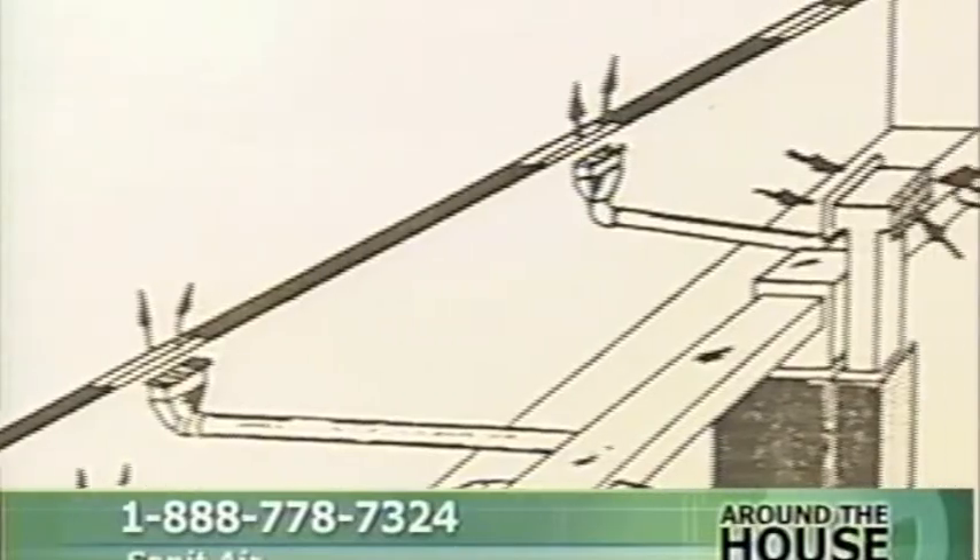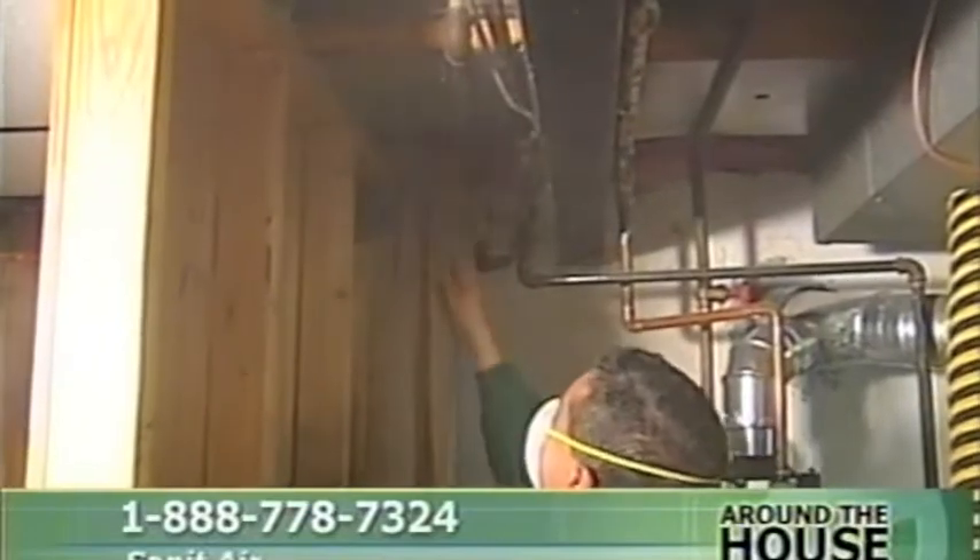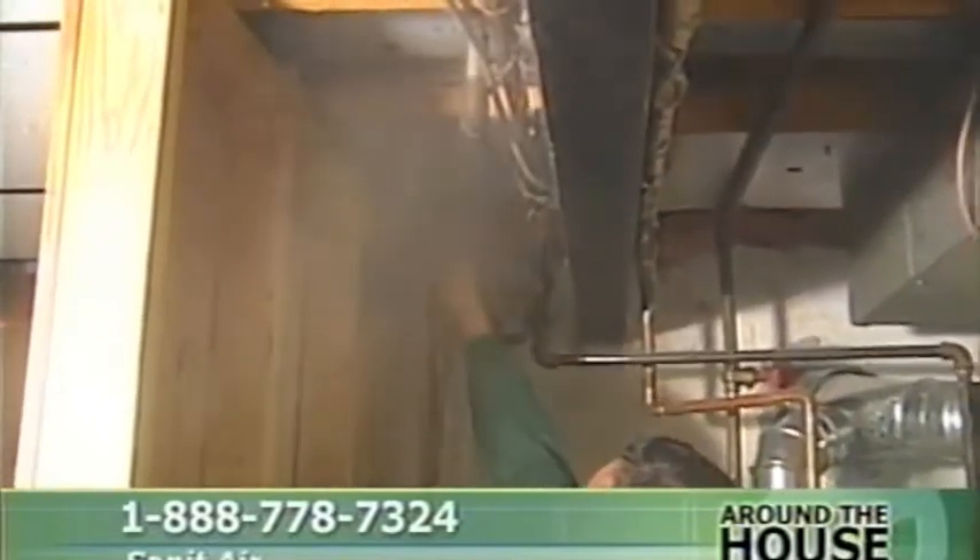So first, what we'll do in a home is tape the vents and registers. Next, we drill one-inch holes — this is what they're plugged with. Into these holes, we insert an air snake that will use compressed air at about 200 pounds per square inch with an air whip on the end. It's going to whip around, clean the walls of the ducts, and move all of that debris to the vacuum.